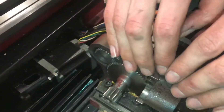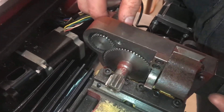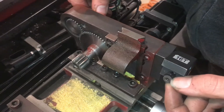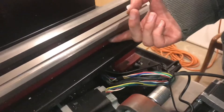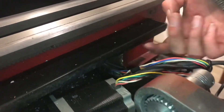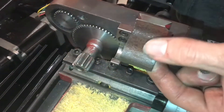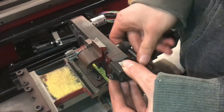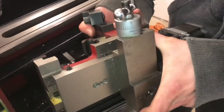On the back is where all the important mechanisms are. From left to right, here's the thread dial, and that engages with the all-thread down here below. And then there's the half nut, which you can't really see because it's upside down. But that lever raises and lowers it, so you'll want to be able to get a different angle on that to see if there's any chips in there.